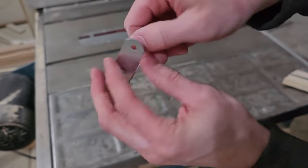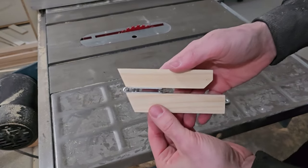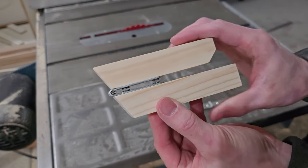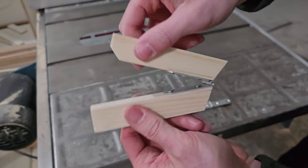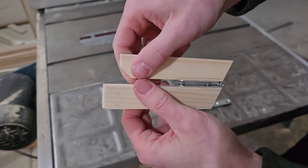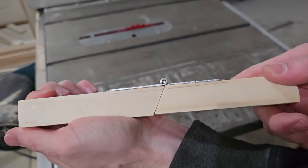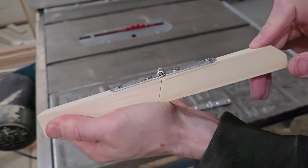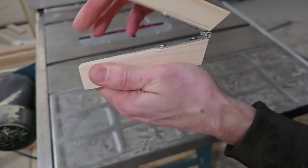All right, so first of all, for the hinges, as you can see here, for the pieces that'll be on the trays, it doesn't sit flat as we need it to. And so I'll be cutting a couple of grooves on each side, so that way when it opens and closes, it will be the correct height. And also, as I mentioned before, this has complementary angles in order for it to sit at 180 degrees flat when it's opened. That's looking good, and we just need to cut those grooves now.